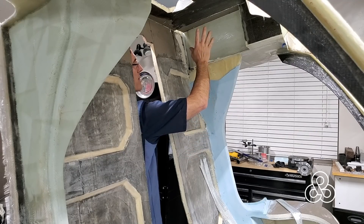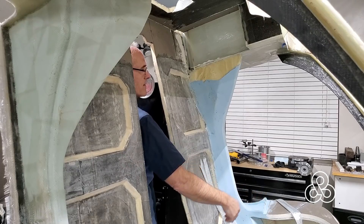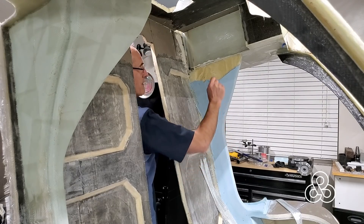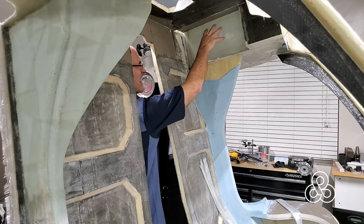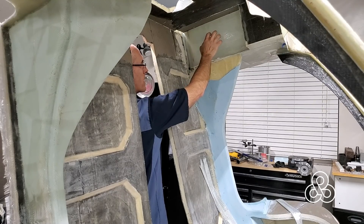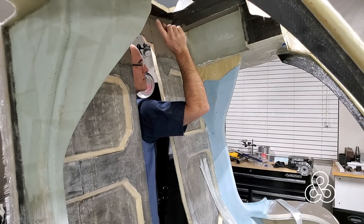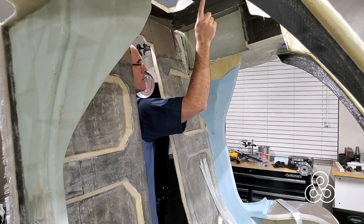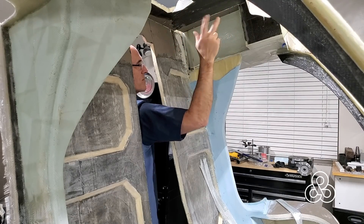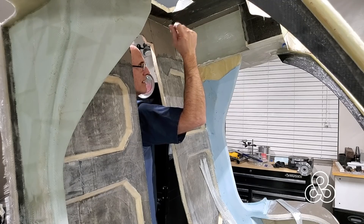In terms of steel structure: we mentioned the tube around the rear bulkhead for rollover protection, and the little side pieces that come and meet the striker plate and go through the door. There will also be a steel plate that goes onto this surface for the hardpoints for the front subframe, and that plate will also have a tube frame that goes up and travels across underneath the dash, tying the subframe sides together. It will pick up a hardpoint on top of the tunnel to add torsional rigidity side to side, and that crossover tube frame will also be the attachment points for our steering and pedal assembly.